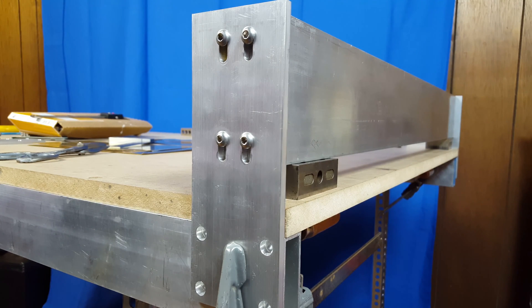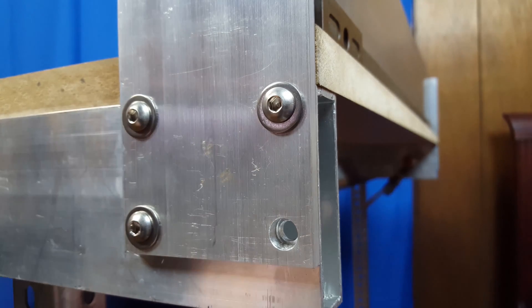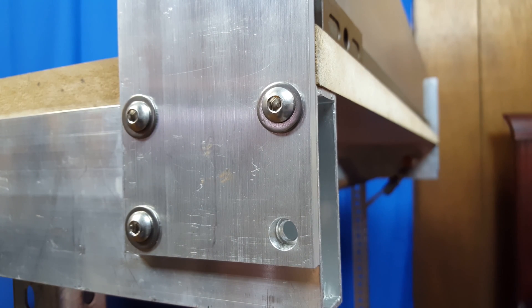So I've got the first rail more or less shimmed up and squared up to the table — as far as I'm concerned it's pretty good. I've got a couple center punch taps in the middle of these holes where it's going to be bolted to the table, and now I'm going to actually drill those holes out and get it attached. So we got the holes drilled. On the top ones I couldn't use bolts — they're just too close to the side wall there — but the bottom ones have bolts actually.